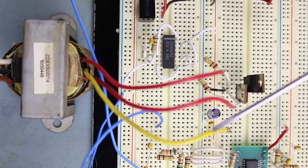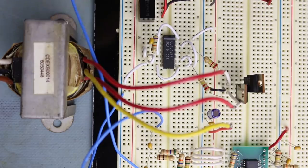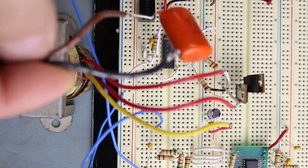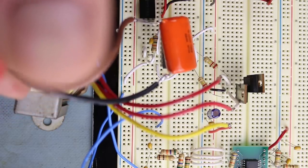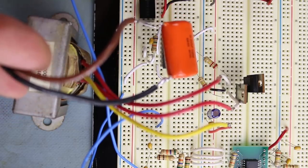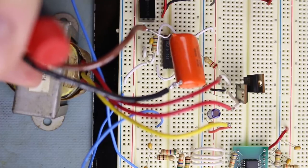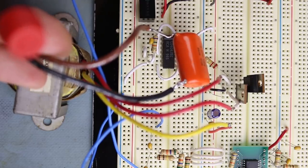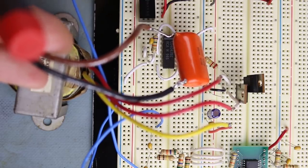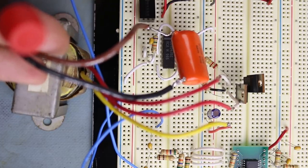Now our center tap is connected to our positive rail, which gives us a reference in the middle. On what we're calling our secondary side, we have to install a capacitor because there's some pretty massive overshoot if we don't, and a lot of noise gets induced into our circuit. Here I'm using a 2.2 microfarad, 200 volt, this is a 100 volt capacitor. Without this, it just doesn't operate properly. So we need to snub those overshoots, that ringing on the edges of our square wave.